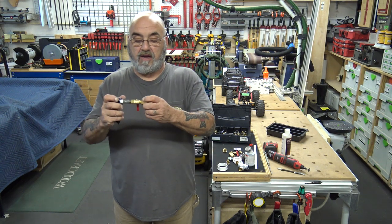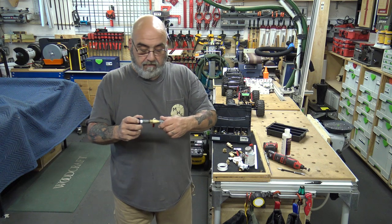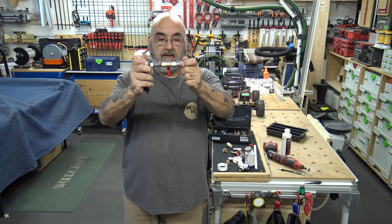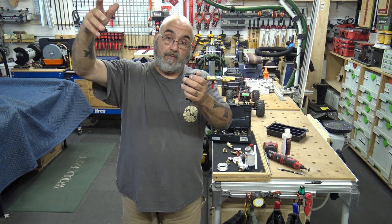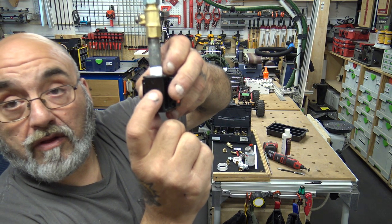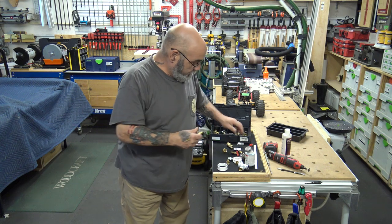Or you can put your chuck on the hose — get the female version of the male end, so the chuck comes from your hose, lock it on. On the other side you can do IPS pipe up to your reel, or CPVC, PEX, whatever. With moisture traps or pressure-reducing valves, there is a direction — follow the direction of flow. I'll give you a quick tip on what we do with things like check valves and gas regulators.